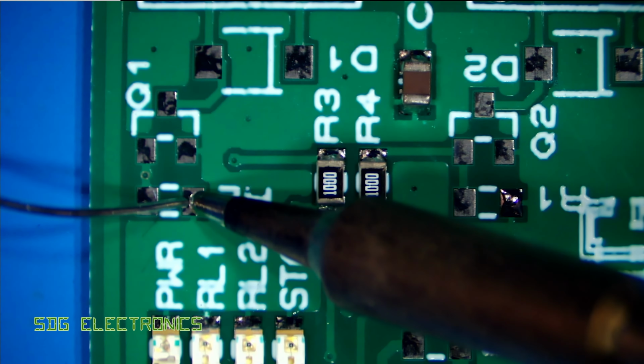Let's just try soldering a 2p coin. It's been a long time since we've done one of those tests. So I thought it might be interesting to bring up the graph on this one. I'm not expecting any kind of performance difference compared to the JBC or the T3A, so let's see what it actually does as we're heating up this coin. So I've got the timer up, and I normally do it for 25 seconds or so. Here we go. Temperature's set to 360. I normally try and do it to 357 just because that matches the Metcal.